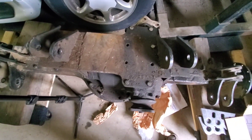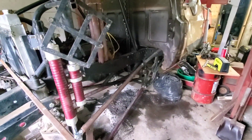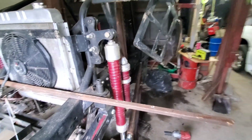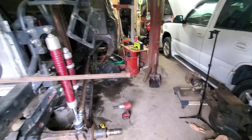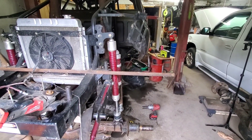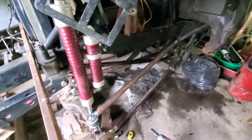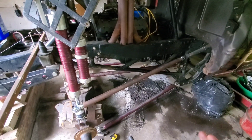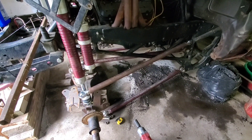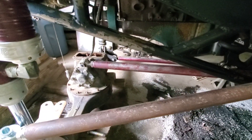The reason we're going to try this is last year we widened the link bars on my top hat, trying to accommodate the dry sump that's on the 565, and it resulted in not enough triangulation in the rear end. My link bar smashed into my $1,500 oil pan a few times. So hopefully doing a reverse triangulation for the four-link in the back should put enough triangulation in the rear end so it shouldn't sway back and forth, and we should have plenty of clearance.